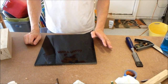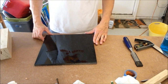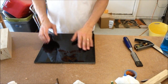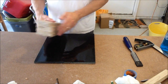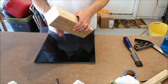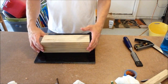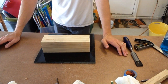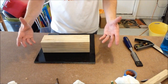I use the scary sharp method to sharpen my chisels and hand planes — I just don't have any planes yet. I use this ceramic floor tile from Home Depot because it's flat, and that's what I use to sharpen with — I put sandpaper on it. I'm going to take the four pieces of wood I just cut and flatten them down to make sure I have a perfectly even bottom. I wouldn't worry as much about it if I had a jointer, but I don't have a jointer or a planer yet, so I've just got to do the best I can with what I've got.